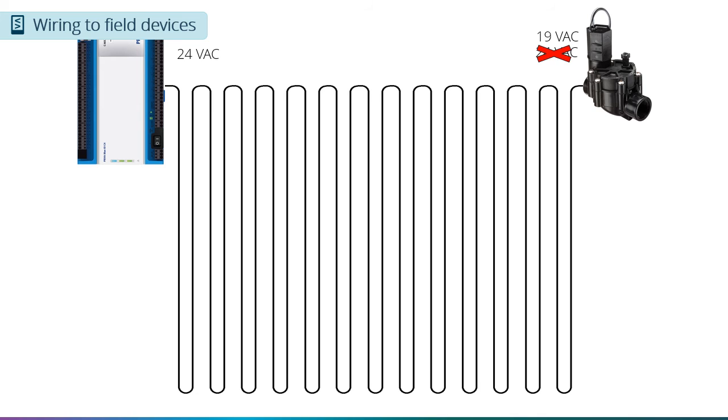But every installation is different. Your best source of information regarding the proper size of the cable is usually your cable supplier. But for them to give you good advice, you will need to let them know about your installation. You will need to let them know the voltage you will be using.